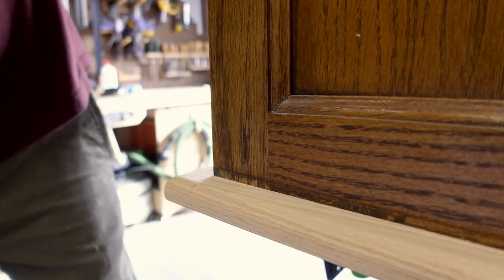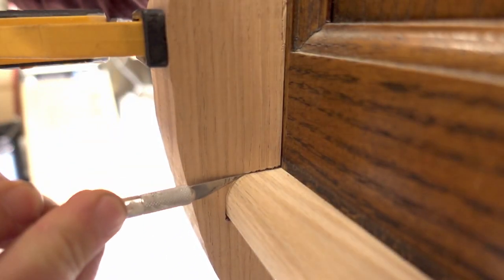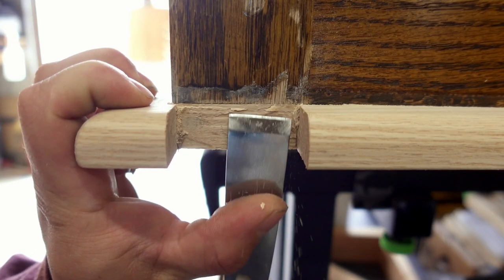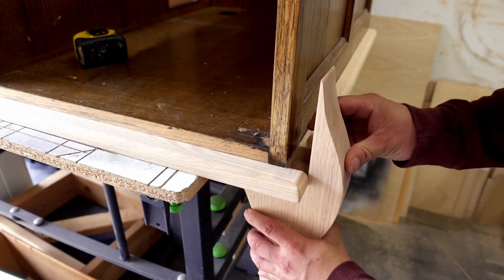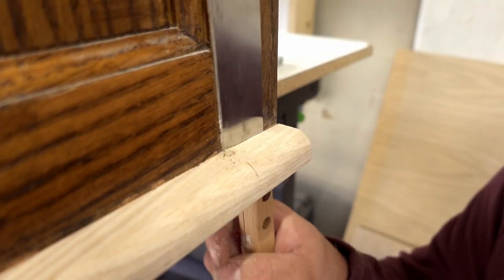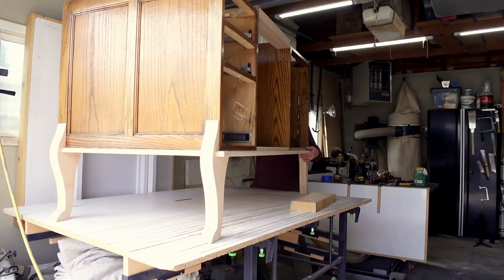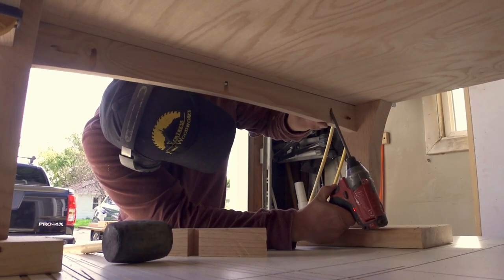While doing the pre-assembly, I am paying attention to how square things go together, and if any problems arise — which I'm glad I do this because I realized that I haven't cut the legs into the base panel. So with a block of the same thickness as the legs, I mark where to cut and use a Japanese saw to do the honors. A multi-tool is perfect for the flush cut, and a chisel works well to clean up my mess. Each leg can successively get cut into place and screwed on. With all four legs installed, the aprons can be tailored to fit nice and tight.